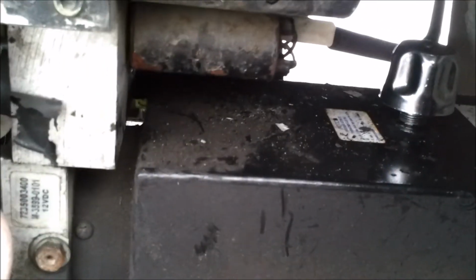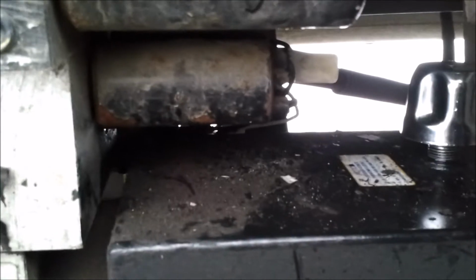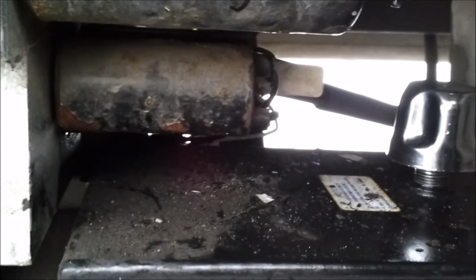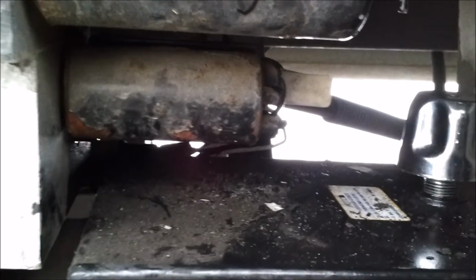So, of course, if you Google that problem, you're going to be told that it's the extend valve, and these are both extend valves down here below, right above the reservoir, on the HWH system. And the furthest one over in this case is the extend valve for that slide out. And unfortunately, that was not the problem. We went ahead and ordered an extend valve from HWH.